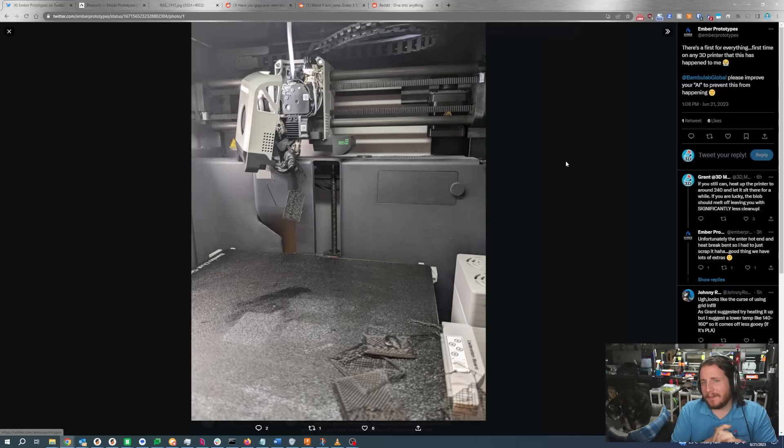For these guys, I don't think they were initially expecting this. It looks like it might have gotten through the first layer and then peeled off. We've got some shmoo on the build plate — I don't know if that's hand grease or maybe glue from a leftover print — but that could be in some relation to the issues. It looks like they had an okay first layer; we can see the rectangles where the first layer was, but something somewhere got really upset and made just a small amount of spaghetti, then destroyed the hot end. This is why we stress having spare parts on hand.